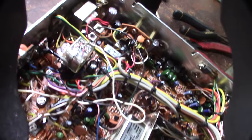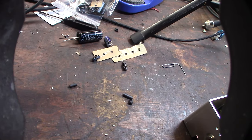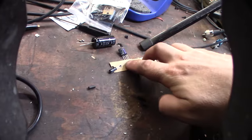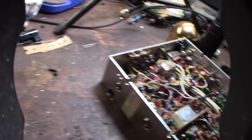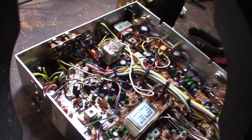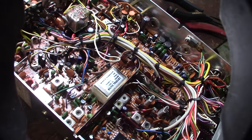Yeah, I'm just double checking, make sure I didn't forget any. Because I do actually have some leftovers, but like I said in the beginning of this video, the original Cobra 139 XLR had an AC adapter in it, or power supply. So I'm assuming this is the filter capacitor for the power supply. So I'm guessing the rest of these were probably in that power supply or extras. I'm not sure, but I don't see it. The cool thing is on his card, he gives you a doc that says where the capacitors go, the actual capacitor numbers. So that was helpful, and also the schematic, so I can verify.